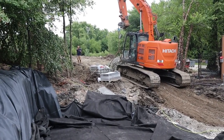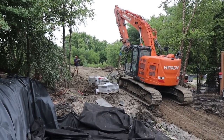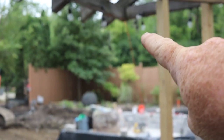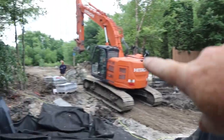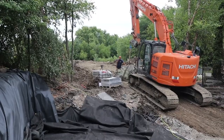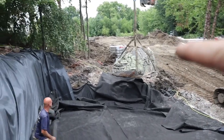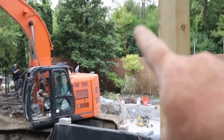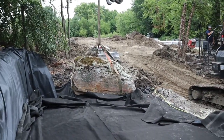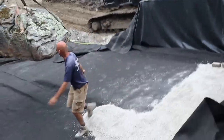First boulder going into the pond. I know it's a formal pond, but we can't help ourselves — we have these 12,000 and 15,000-pound rocks, and this one weighed in at 13,500 pounds. We want to use it to support our pergola: the six-inch post coming down from there will be accepted by that giant rock. The rock is actually tapered from one side to the other — the higher part will sit where the post comes down, and we taper it toward the window so when looking through the window you get to see a little more interest than just Unilock wallstone. We like our boulders — we're still pond guys at the end of the day.